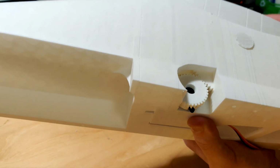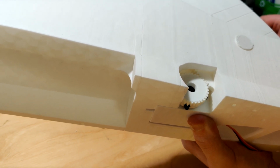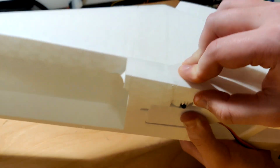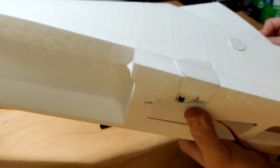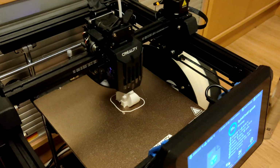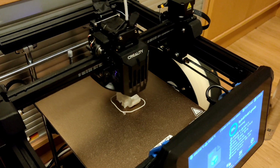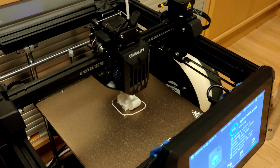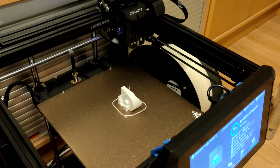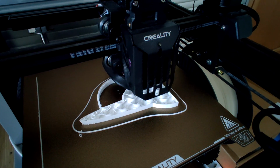There's also a somewhat slightly annoying issue, which is when I ordered a specifically 270-degree servo that would require a servo expander to actually achieve this full 270-degree rotation, I was actually shipped the 180-degree version of that servo. It is not a massive issue, the 180-degree servo would still work, but if I use that servo, the swing wing mechanism would only be able to swing the wings back to about 5 degrees in front of where they would be fully swung back. And I'm not entirely sure if I want that. It would be good enough to test the capability of the prototypes and if the swing wing works properly, but it wouldn't be able to completely fold its wings back properly.